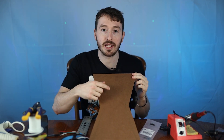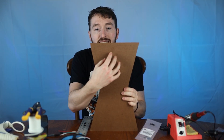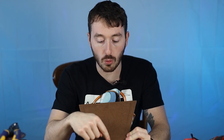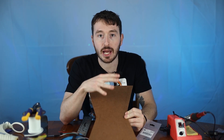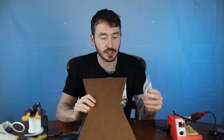We're going to use this accelerometer I got from Adafruit — I haven't used it yet, so we'll find out if it works. We're going to connect an ESP8266 to read from the accelerometer and determine which LEDs to light. Based on the orientation, we'll start sending LEDs down like grains of sand. We made the hourglass a little wide to accommodate wires connecting the LED strips.